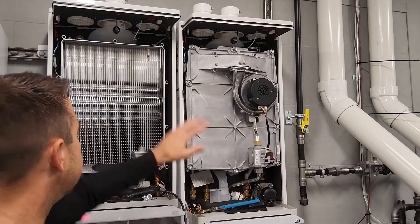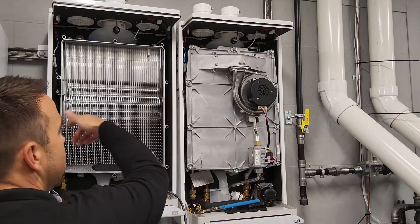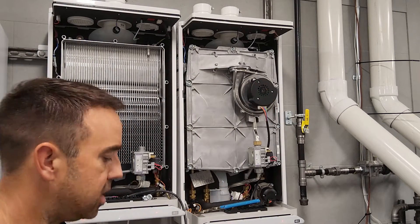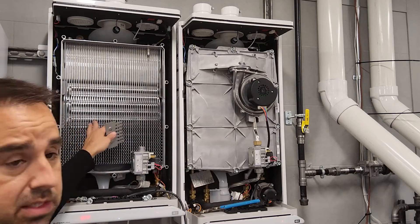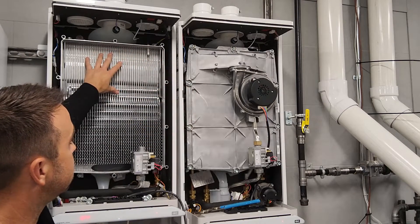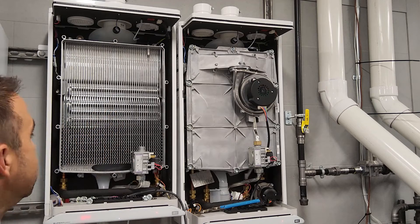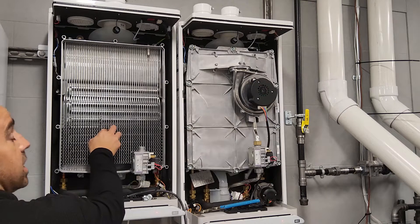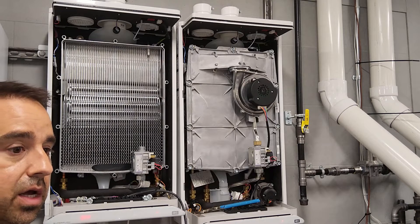When you are spraying that cleaner, you want to be careful not to get anything on any of the other components. What I recommend is taking a trash bag and putting it around the outside, then spray it. After spraying, let it sit. If there's any other kind of hard deposit on there, IBC came out with this stainless tool — it's a P917. I'll include that in the description below. It basically gets into this labyrinth-style design for the heat exchanger. Our burner transfers the heat right here and all the cold water is coming back right here — this is where most of the condensing is taking place and where it's probably going to get scaled up eventually. You just slide it right into these passes and it makes it a lot easier to clean.